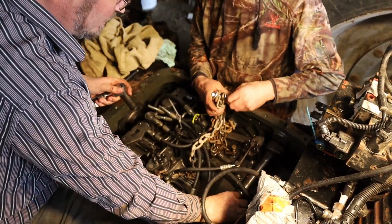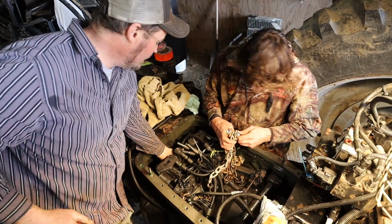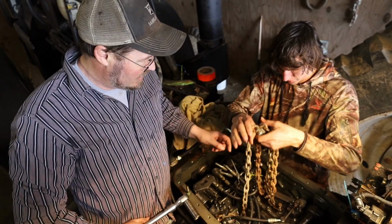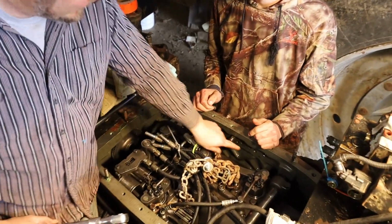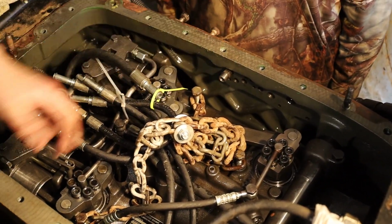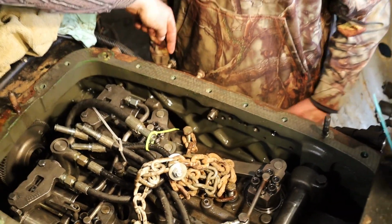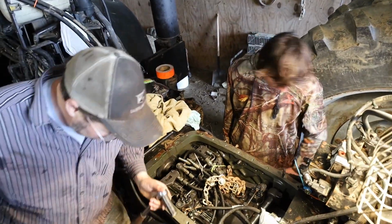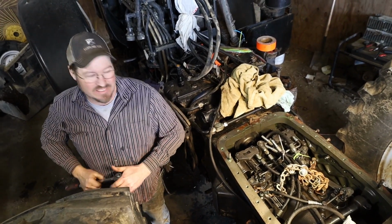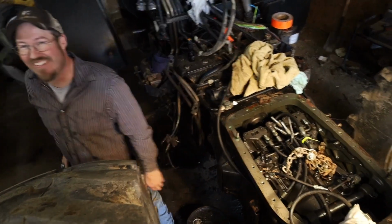So we're going to loosen up the clamps, these two there. This tranny sits on two rods that go through. We got the front input shaft unhooked, the sun gear in the back unhooked, the output to the rear end unhooked. All these hydraulic lines go through all these holes, and then there's a valve body on the outside, but they are all off. So we're pretty much getting ready. That nut's got to be taken off, and the one down below. But we'll have to grab a loader tractor and start picking on it, and hopefully it comes right out.